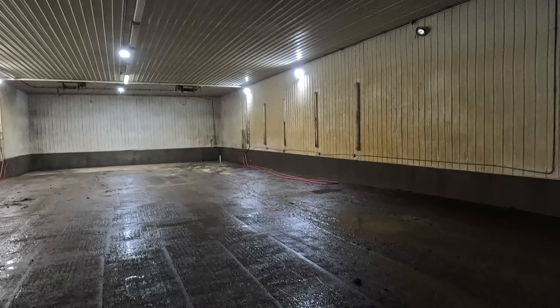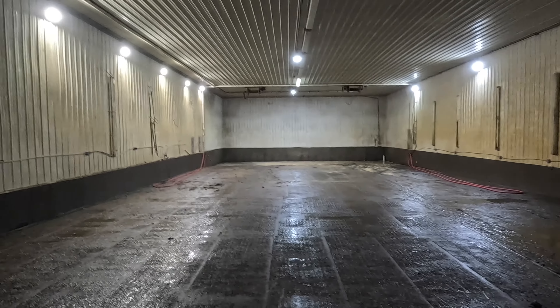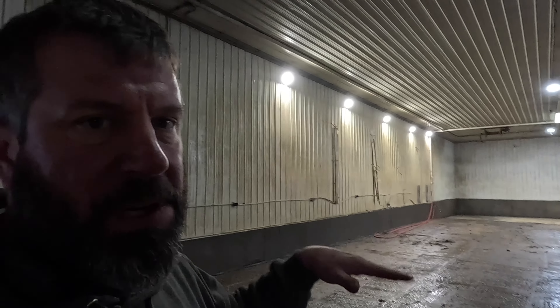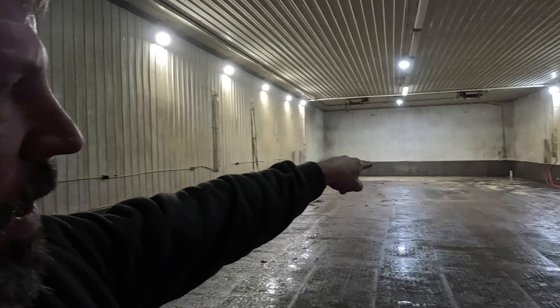This is our washout here at the farm. This building was specifically built to wash out cattle trailers and clean off equipment — not fine-tuned cleaning, you're not really scrubbing things in here very much. Two big fire hoses on the side. The floor naturally slopes to the back where it drops down about four feet. We'll come in, scoop out all the solids, and all the liquid runs out the back corner and into the lagoon.